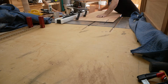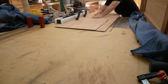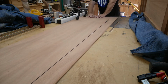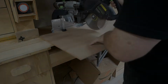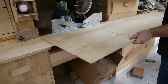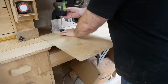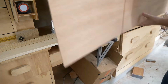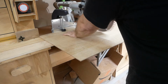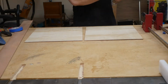And so I was going to use some 1/2 inch ply for the bottom 2 doors and as the center section, and they didn't have any, so I had to get the 1/4 inch. And I'm gonna have to cut these pieces down, as you see right here, and glue 2 pieces together, laminate them together to make my 1/2 inch plywood. And as you can see there, I'm using a little stop block so I can make sure everything's gonna be cut even.